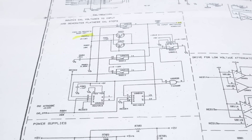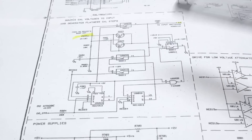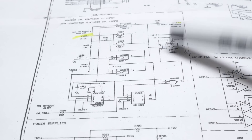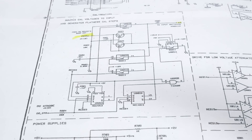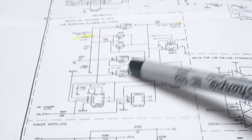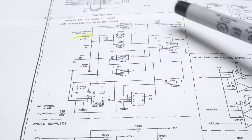I'm going to be setting up my oscilloscope to monitor the enable pins - 1, 2, 3, 4 enable pins - pins 1, 8, 9, and 16 on the DG211. That will tell me if it's supposed to be conducting or not conducting, on or off. If it's high, it's on; if it's low, it's off. And then I'm going to be monitoring the input and the output, one scope probe here and one scope probe here.